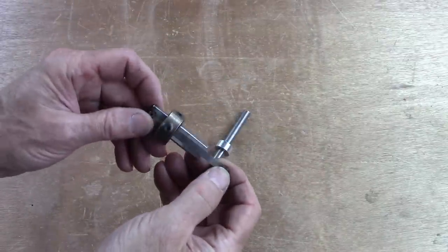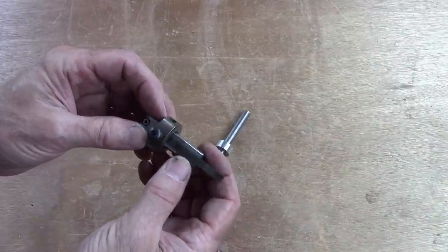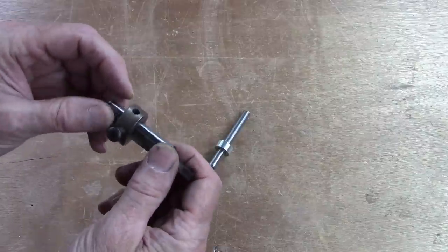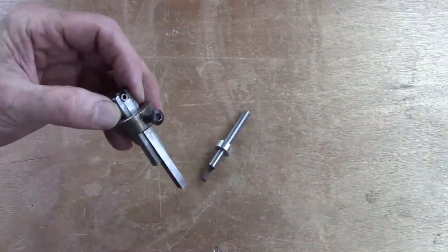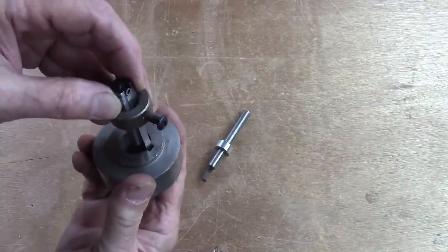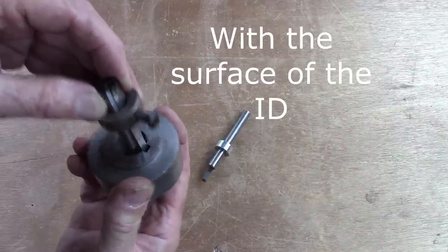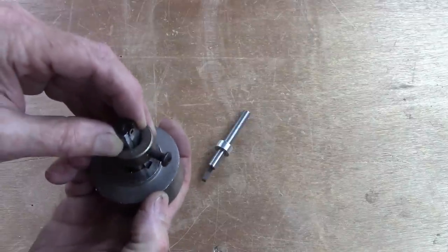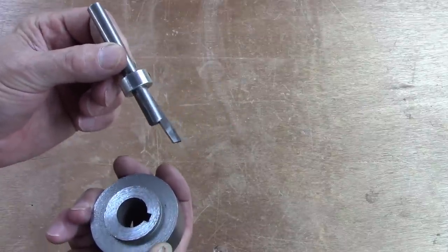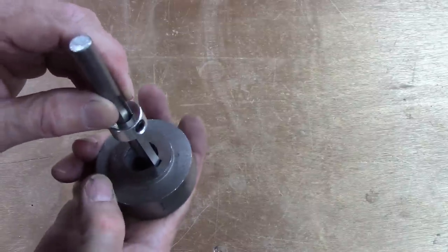This is the one I used in my last video. It worked good — it was basically my first attempt and I've used it several times. I made it with a half-inch shank and that collar holds it in there. The problem was I had to mill off right there because there was an interference with the edge of the pulley. If that was round it would limit how deep I could go with the keyway.